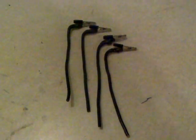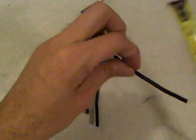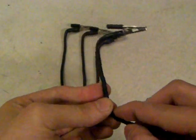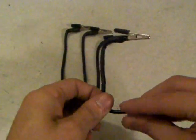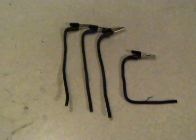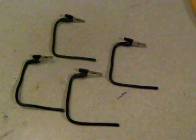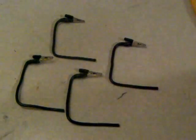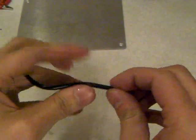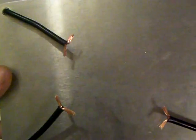The next thing is to measure out to the three inch mark from the top, or from the bend of your alligator clip, and we're going to bend that outwards towards the same direction as your clip. That's going to go underneath. Once you have all four of the alligator clamps bent down at a 90 degree angle at the bottom, we're going to take a small piece of cable from the bottom and split that in two — we'll show you why in a minute.